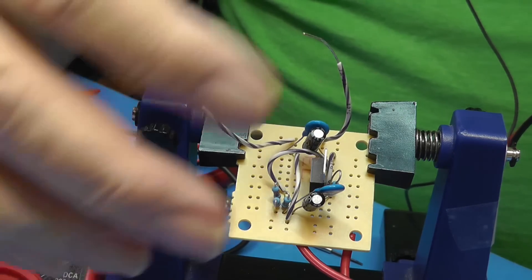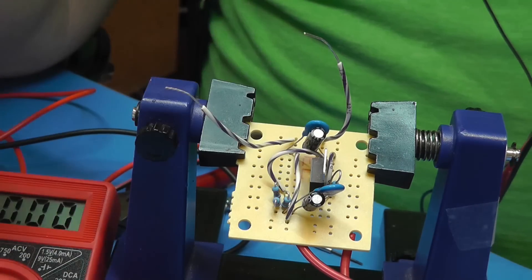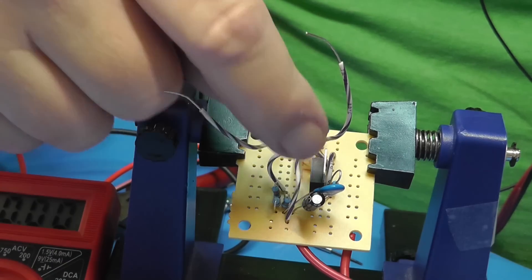We have built from scratch a 4.55 volt, 4.5 volt regulator. I made this with junk box parts except the IC. And this, by the way, is a solder removal tool — I had to use it. I had one of the electrolytic capacitors in backwards. Fortunately I caught that when it was very easy to unsolder it, take it out, and put it in the right way. Electrolytic capacitors are polarized, so you have to get the correct part to ground — it doesn't show in the schematic, but you do.